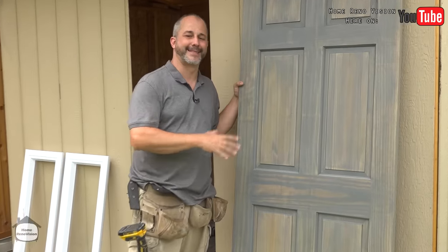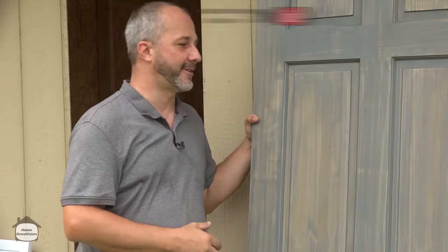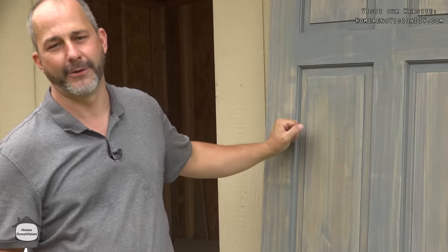This is a solid wood door — not a laminated panel — so it's good for exterior use. We've finished it off with a lovely gray stain and a few coats of oil-based polyurethane, good for exterior, and we did all six sides. We really set this door up to perform well outdoors. We also have an overhang and the way our shed is laid out it shouldn't get too much weather exposure, but it's always good to be a little more protected than necessary.